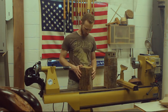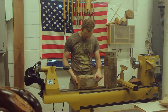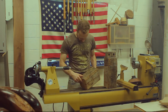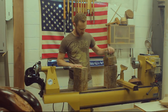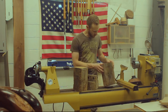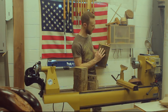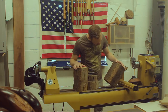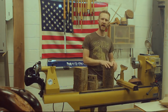The first thing to do when you're going to turn barn wood is to inspect it really well for nails. I've looked through these pieces here and there might be a few very small siding nails here and there, but every once in a while you'll come across a spot where you have a relatively large nail. You don't want to turn those pieces unless you can get the nails out because they really play heck with your tools.